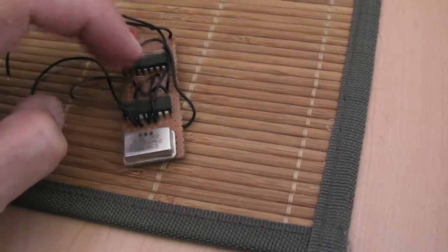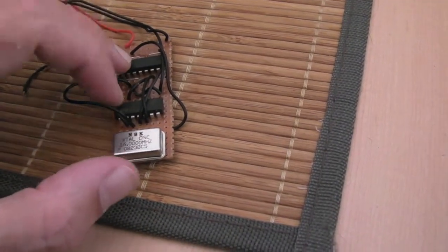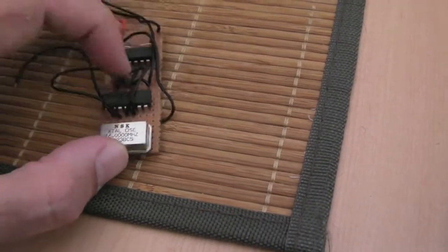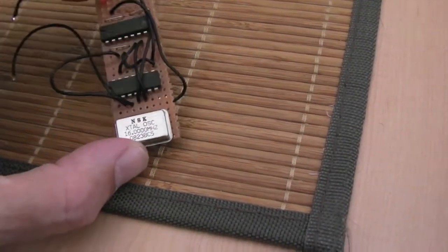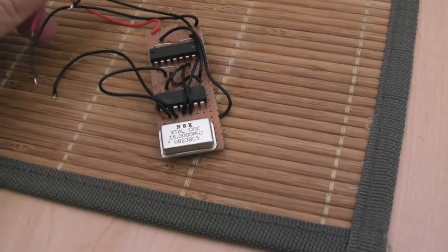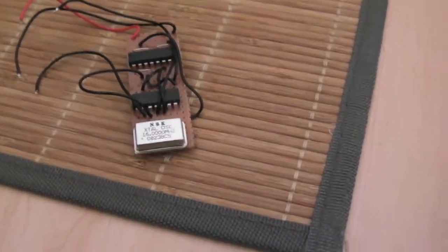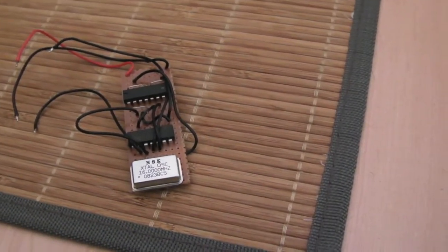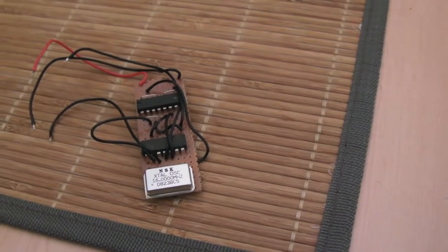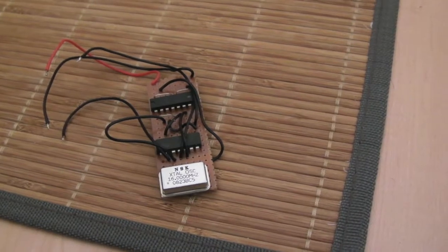It doesn't work. I've tried this with both 74LS chips and 74HC chips and I must have checked the wiring up a hundred million times. I need to get my scope out for this. I've got a 16MHz crystal and I'm damn sure it's all wired up correctly, but it just will not run at 16MHz. It runs at 8 — switch it to 16 and you get a white screen. Typically you get that when the CPU is locked up or won't initialise, due to the clock speed being too high.